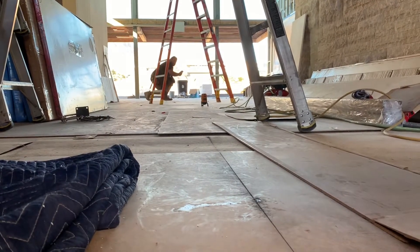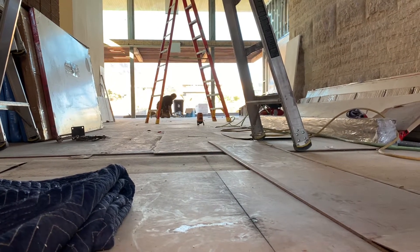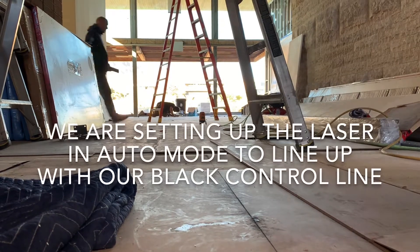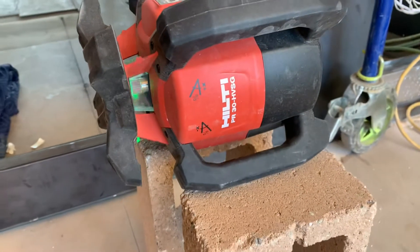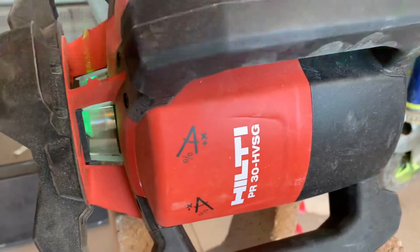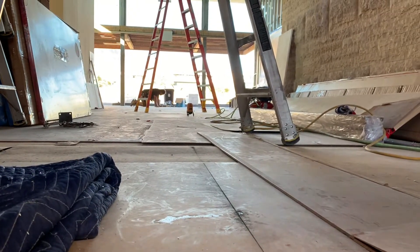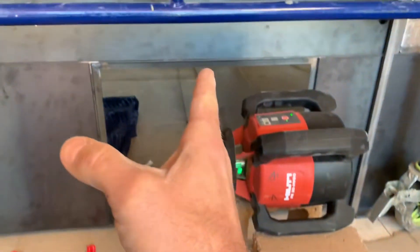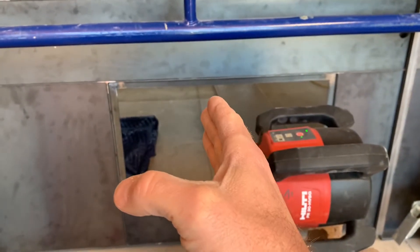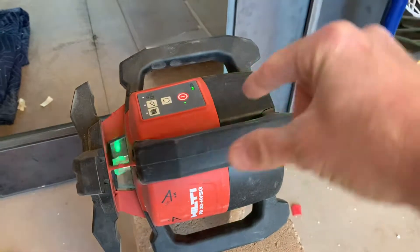What he's gonna do - he's running this whole laser off that receiver and it's in auto mode. It's automatically gonna line up with the center of his receiver as soon as it does a solid beat. The laser automatically went from here, found his receiver, moved, hit zero, and now it's gonna stay there. So now we're lined up automatically - we're not moving this at all, it moves itself.